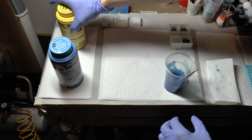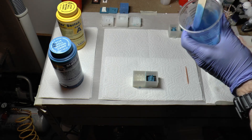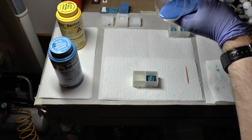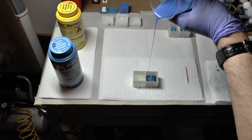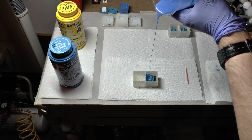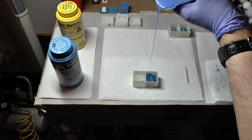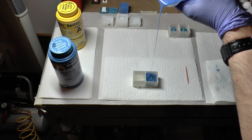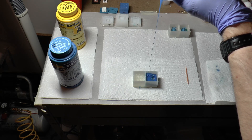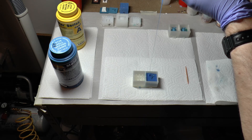The third part of bubble elimination is to pour from a high height. I'm going to try to pour it this way so it can be shown on camera — this is a little awkward. You want to aim and try not to hit the sculpt itself; pour off to the side a little bit and let it flow around from the bottom and rise up, so it's not going to trap a bunch of bubbles — because if you have bubbles they become lumps. With this stringy pour, every one of those little bubbles is popping in the stream on the way down, so very few bubbles actually make it in. You can see there are bubbles still in the cup but you're not seeing those in the final mold.